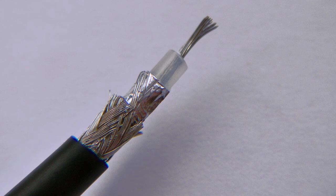I'd also like to mention that some cables, instead of having two wires, are more like a coaxial cable where you have a shield of wiring around a center wire in the middle. You can still splice those too — typically all you have to do is take the shield, pull it out, twist it around, and make it like a single wire. So you can do either kind.